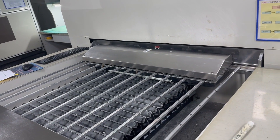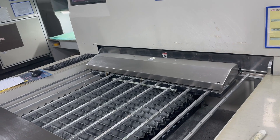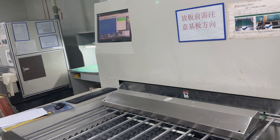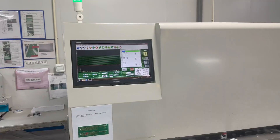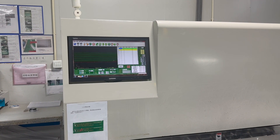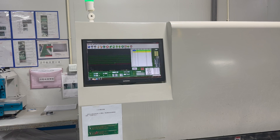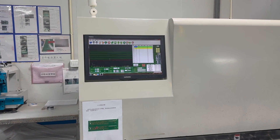It is also important to understand the type of laminate that is going to be scored. Higher-temperature laminates have a heavier material weave with less resin, requiring a deeper score cut to avoid fracturing. Standard laminates should not be scored too deep, as this will cause the array to be fragile and break prematurely.